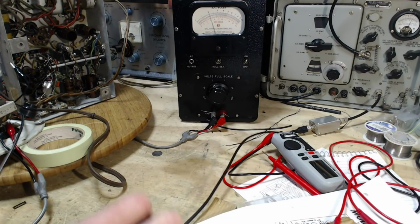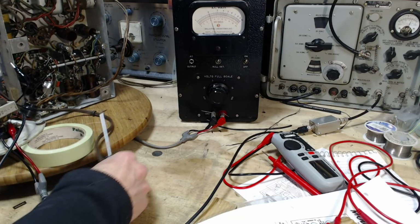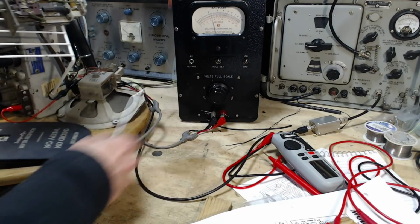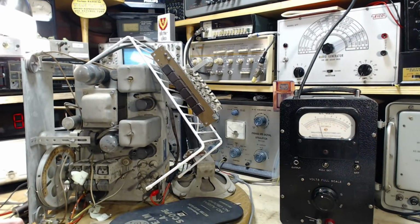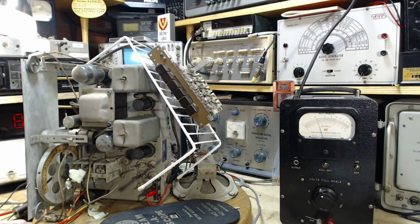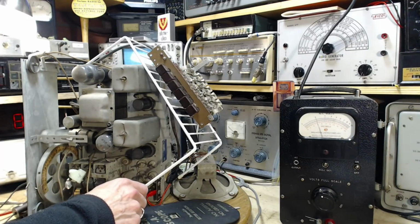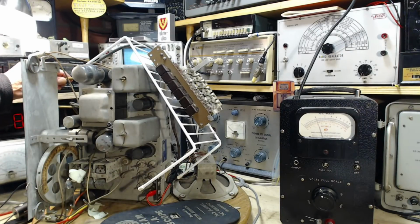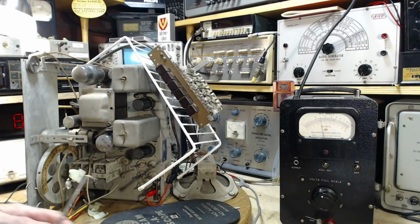Now let's get on the correct tuning thing, which may well be correctly adjusted from the last time I did it. But I'm sure there's room for me to mess it up. There it is. Pulled all the way up, which means minimum capacitance, based on the instructions for the other radio. That's where you should start, especially if your radio is way out of alignment like this one now. Okay, well, let's check the meter there. Well, I don't hear the tone at all. I need a little bit of tone.